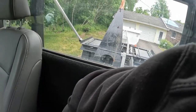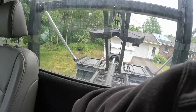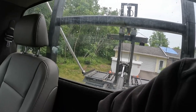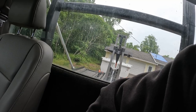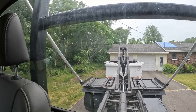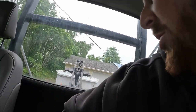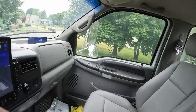Hopefully you can see — give it a little throttle. Without the throttle you can see it's going kind of slow. You can speed it up a little bit by giving it a little RPMs, not much over one K, but it's enough to get it going. Now straight back, basically like that. We're lined up, back in neutral — now we're just going to move the hook piece up. Hook is on, the dumpster is hooked. Going to pull the e-brake and get out and check.